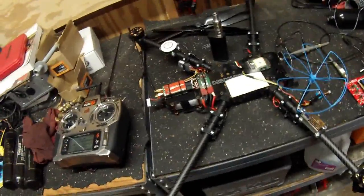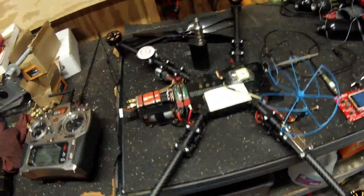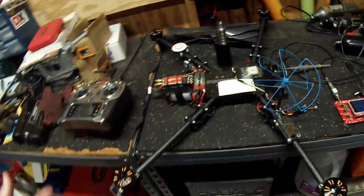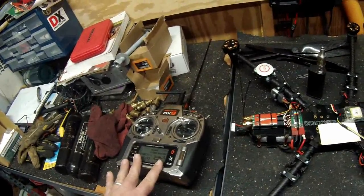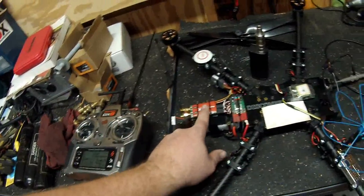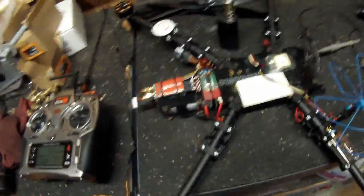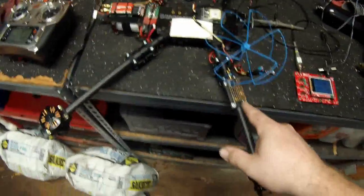Having some noise issues with some recent upgrades. I got my TBS Disco here - I've upgraded up to the 400KV motors with the 15-inch props and the 6S LiPo. I also switched from the regular 2.4GHz control link to the ImmersionRC 433 band. Yes, I have my ham license, I'm legal.